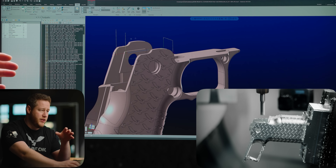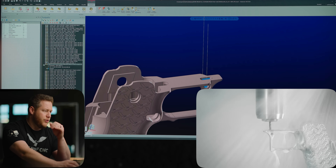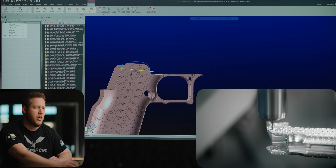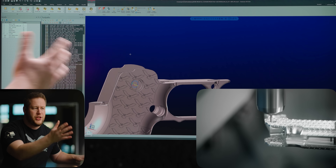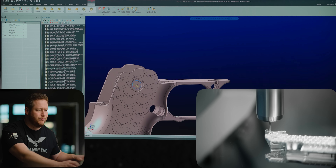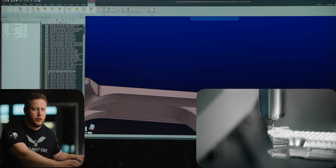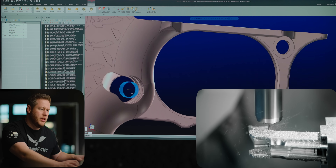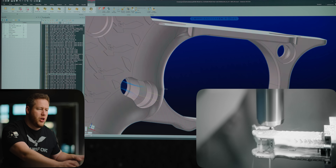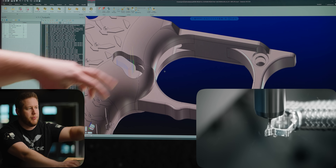The next tool coming in is an 1/8 inch end mill to do this slot right here. Then I'm going to come back up and get rid of the excess stock on the outside. After that, we're going to start finishing our holes — circle milling the hole and counterbore here, as well as the counterbore and through-hole on the trigger guard side. Then I'll come in with that same tool and rough a little bit deeper on the mag release hole, as well as do the contour for that little shape.